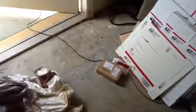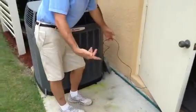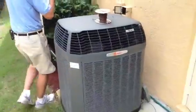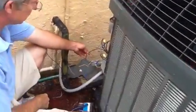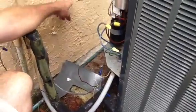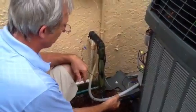What we did was run a separate wire from the indoor unit out to the outdoor unit to bypass the problematic area. Here's where we tied in the new wire. Same color code as inside. To fix it properly, we're going to drill a hole through the wall and sleeve it with a nice piece of flexible PVC conduit.